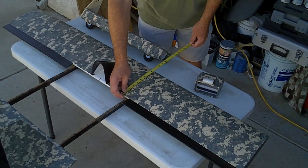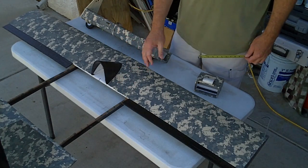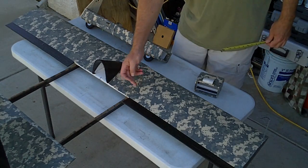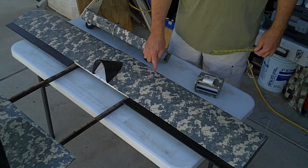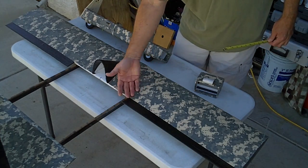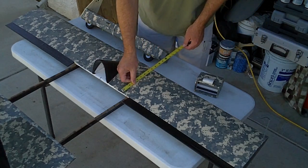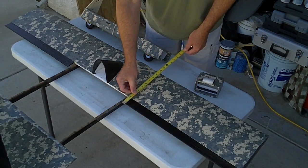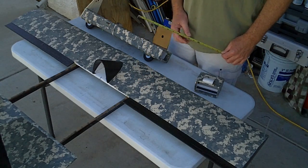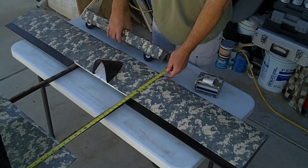And so what you see here is approximately 9 inches overall. You do lose a little. If you do it completely and use the whole sheet, it's like 9 3/4 to the score on the inside, and you remove all of the paper on the top of the inside of the wing. So this dimension is 9 inches. A control surface of 1 3/4 here. Alright, so that's the wing itself.